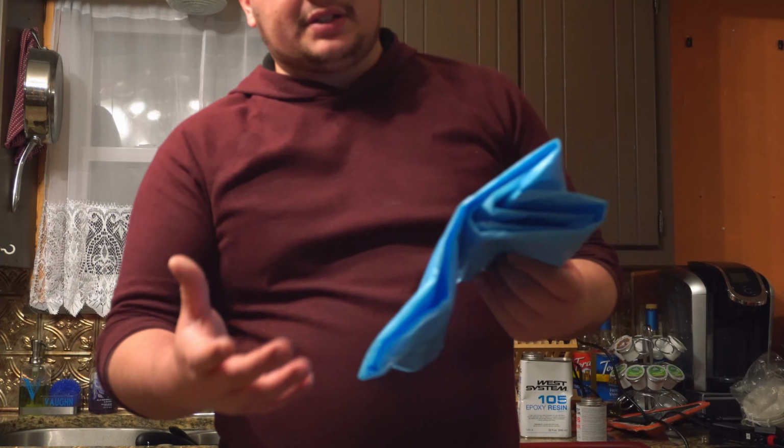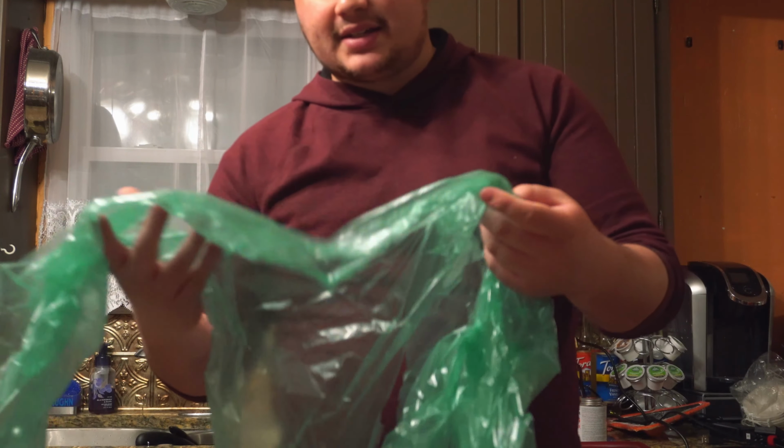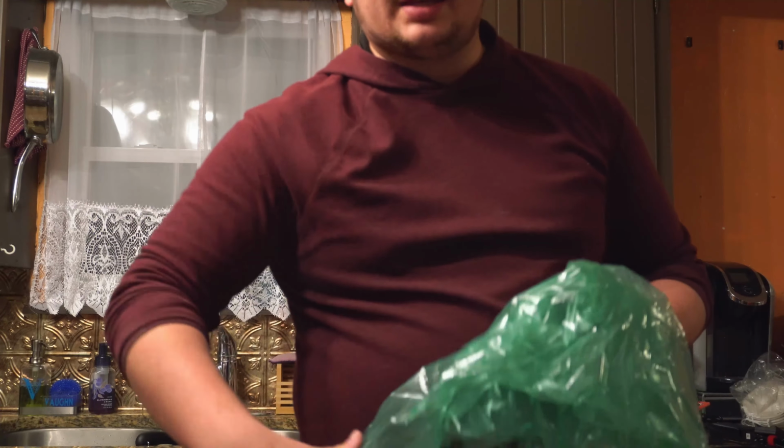While Sean's working on the carbon fiber, I'm gonna use that same template plus a little bit extra for this perf, so it's that plastic sheeting with holes that are poked through the middle that'll help separate our bagging material from our part. And then we'll also use, of course, the actual vacuum bagging itself. This is a little bit stretchy, but we wanna be able to make sure that we can get all down in all the grooves and everything. So we're gonna cut that very loose.